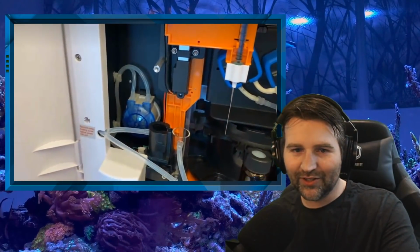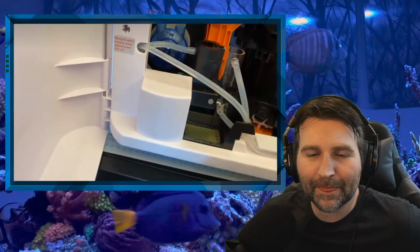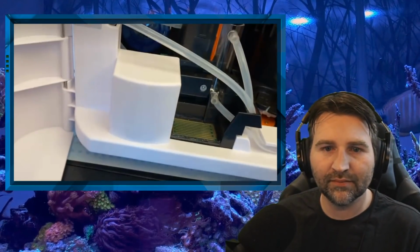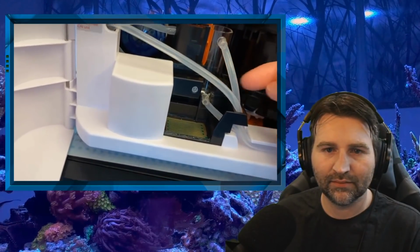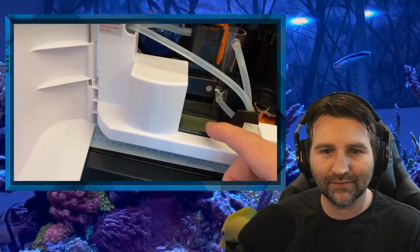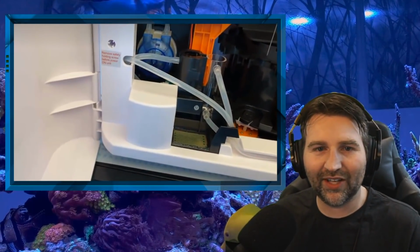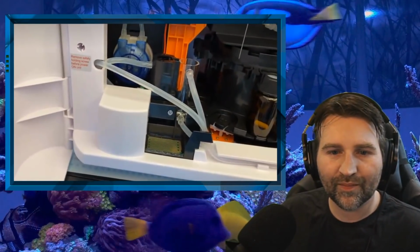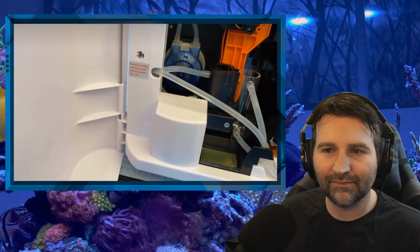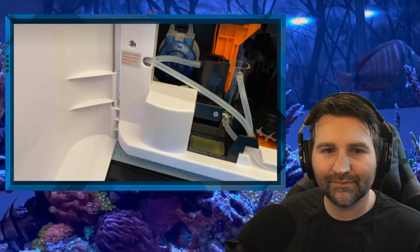Oh, one thing I noticed, you have a water sensor below the tester chamber too. So like a leak sensor. Yes, correct. That's a nice addition. Right here, that's a leak sensor. In any case, if there's water leaking out or overflowing, this whole black part will hold the water and funnel it down to the leak sensor. As soon as the leak sensor detects any water, it will stop the whole machine. That's a nice fail-safe. That's something we added, and I think it's important because it's such a small vial. It's easy to have overflow if you're not careful or there's some malfunction.